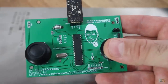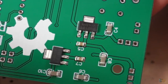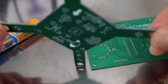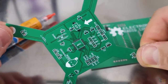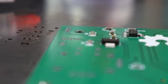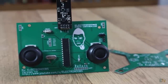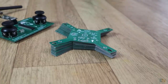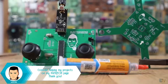In the case of the transmitter board, the need for a stencil is not that high — I just wanted to show you an example. But in the case of this flight controller board, if I were to make many boards of this, especially with this SMD ATmega chip in the middle, I would definitely need a stencil sheet. As I said in past videos, these two boards will be a future Kickstarter campaign. This is the third version. Once I have the drone running smooth, I will definitely order stencils for all the boards and be able to solder all the SMD ATmega chips for all the ordered PCBs.